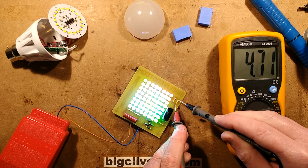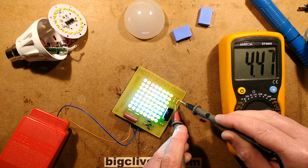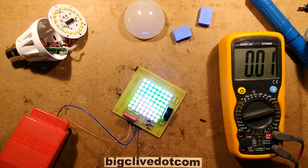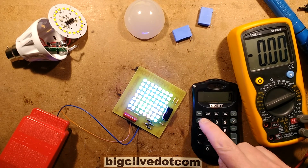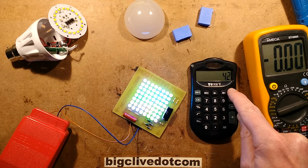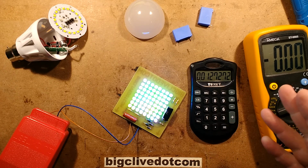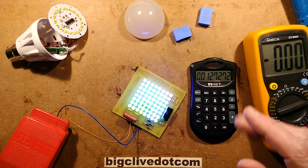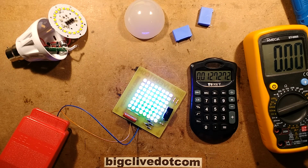It's showing about, yo-yoing up and down. It really varies. It peaked about 4.7, so do we just say 4 since it's a sort of average? Let's say 4.2, it's yo-yoing up and down. So let's say 4.2 volts across a 330 ohm resistor. 4.2 divided by 330 ohms equals about 12 milliamps, but it does peak higher than that. That's with a 1 microfarad capacitor.